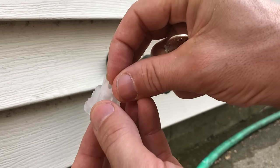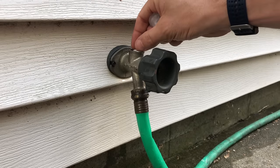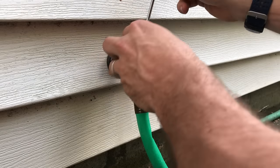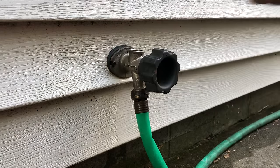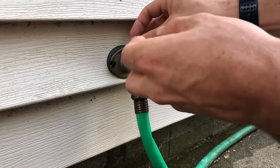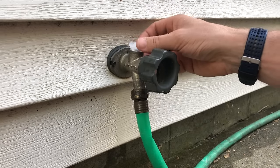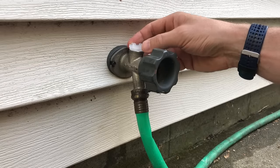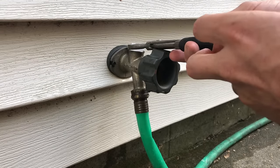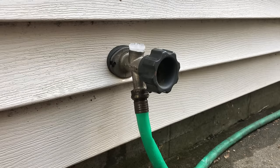All we're going to do is place that little plunger within the casing. If it falls out, make sure it does seat well as you screw this in. Then just hand tighten it — should be pretty easy. Do not over-tighten this; it's just plastic so you can easily break the casing. Really just get it snug in there, just another quarter turn or so.